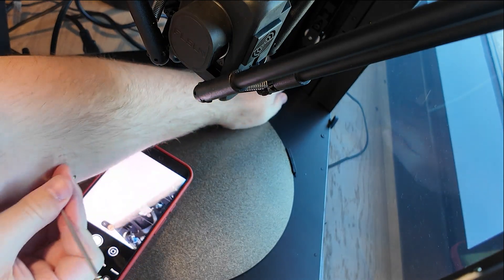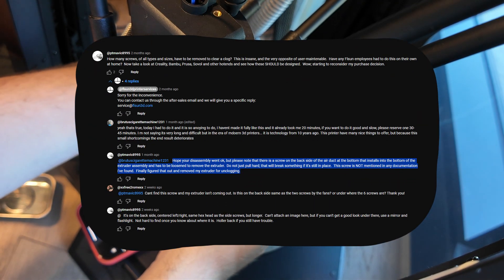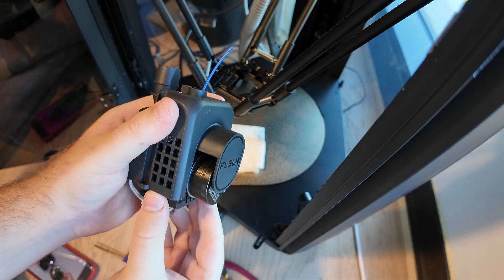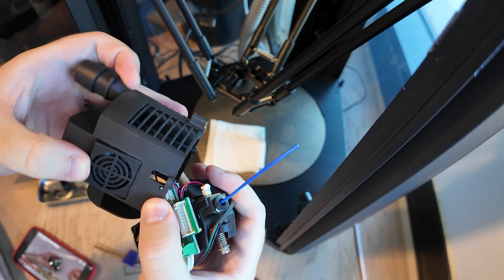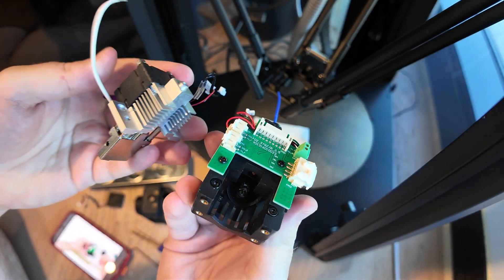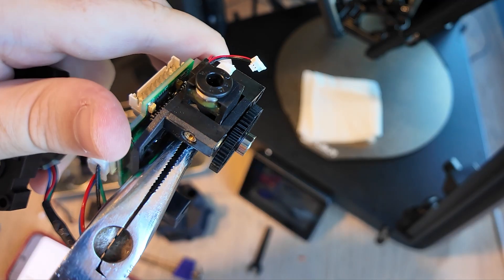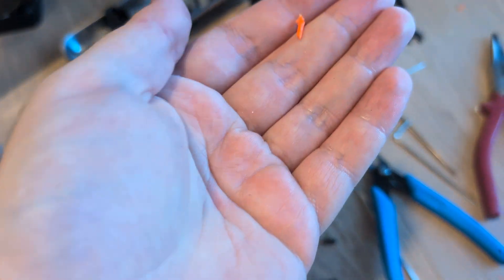Make sure you don't drop any screws, otherwise they'll fall into the void and there's no way to get them out. The video guide just says to remove the extruder assembly, but there's actually one more screw not included in the disassembly video at all — so thank you to that user for pointing that out — and after that the extruder just lifted off. All the connectors are glued into place, so I had to snip off all the glue before unplugging everything, take out more screws, and disconnect the hot end. Then after a few more screws I found and removed the issue. I've never had to undo something like 15 screws just to get at the extruder gears. It all just feels so poorly thought out.